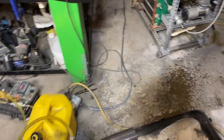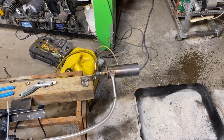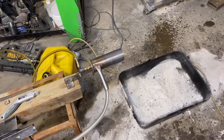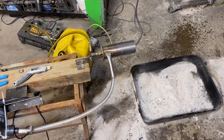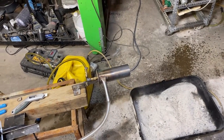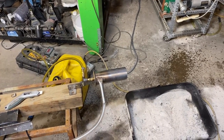We could wrap the fuel coil around the combustion chamber to preheat the fuel before it's introduced into the combustion chamber. That does work. However, there's a problem with that idea. Over time, something called varnish buildup takes place on the interior walls of the preheat coil, and when that happens you start to lose the preheat effect and eventually you'll just clog up altogether.